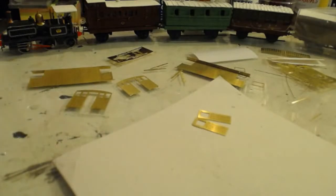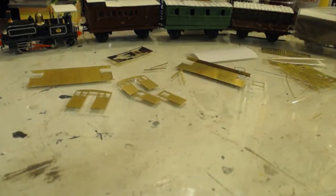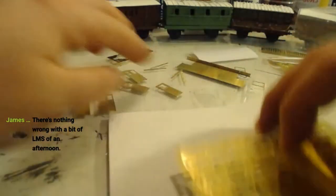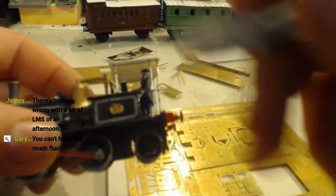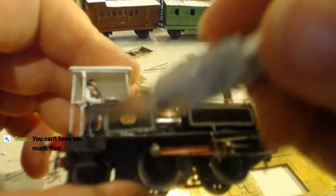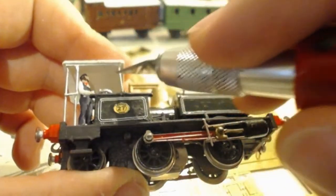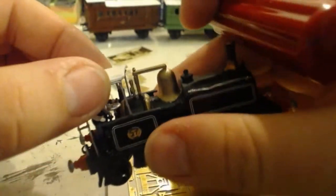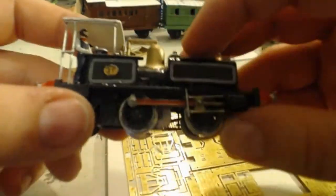Right, I suppose I should turn on this soldering iron, which, as it happens, is already heated up for soldering brass, because all these new supports on here are very soldered. Actually, the originals we built on stream were just the three uprights. This now has a cross member here, which there was on the drawing, and one across the top holding all three together, which gives us a very secure structure that doesn't bend in any way whatsoever. So that is held together very nice and strong now.